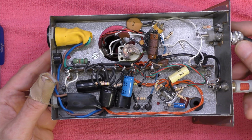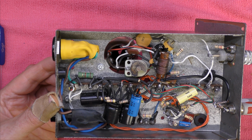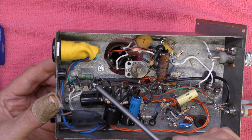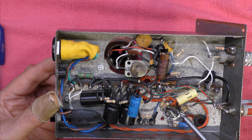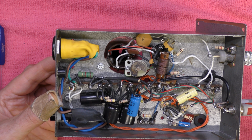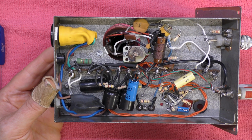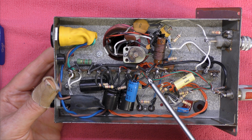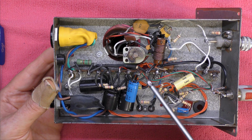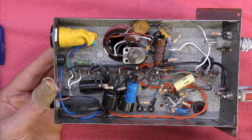Here's the underside. Those of you who are observant will see that I've got a secondary rectifier here and a minus supply. I've modified this circuit. It uses suppressor grid modulation. So basically what it's doing is modulating the suppressor grid. I've got the suppressor grid held at about 33 volts with this Zener diode here, and then I feed in modulation from the audio valve.